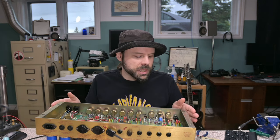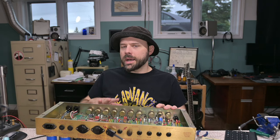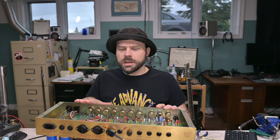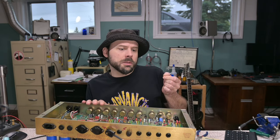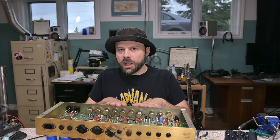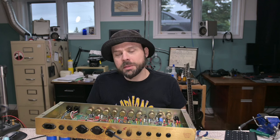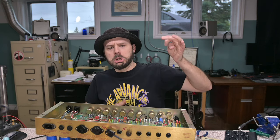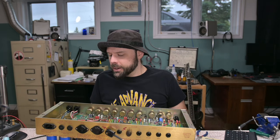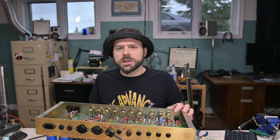If this was my amp and I was seriously using and gigging it, I would be very tempted to redesign the switching in it. However, the caveat is when you have the amp dialed in for actual use, it's not a problem. If you crank the normal clean channel up to the point that you can hear bleed in the distortion channel, and then switch over to the clean channel, you're going to find it is an order of magnitude louder than your distortion channel. The volumes aren't in the same perspective. According to the guy I'm talking to, he's not too interested in the clean channel and he's not gigging professionally, so chances are he'll just turn it down and it'll never be an issue.